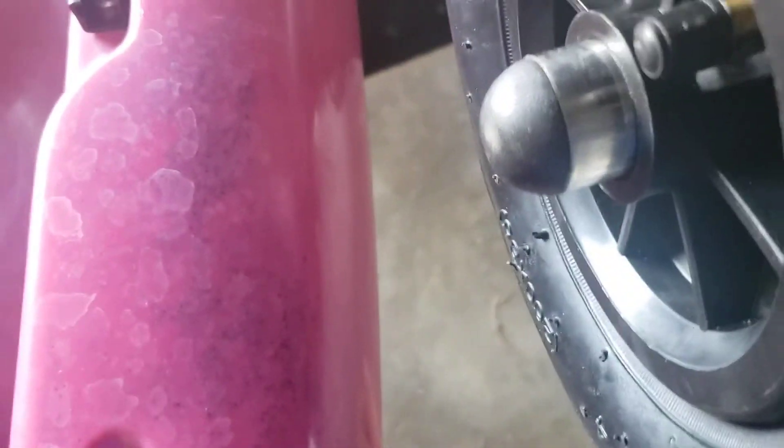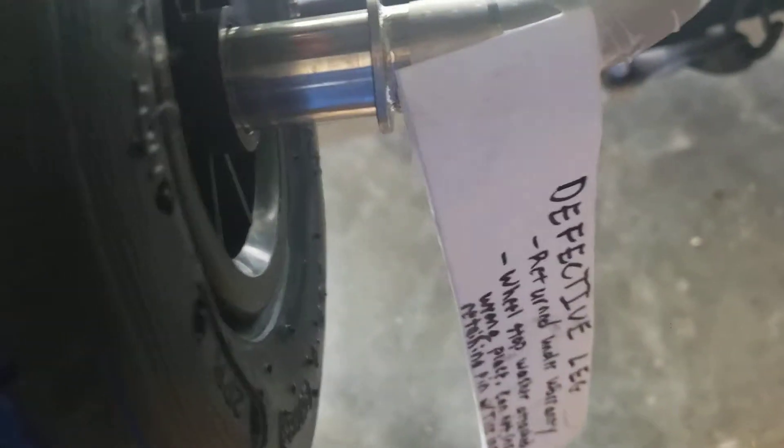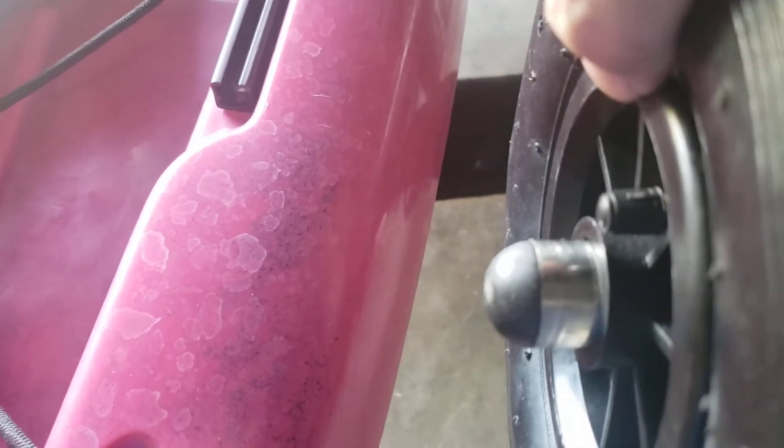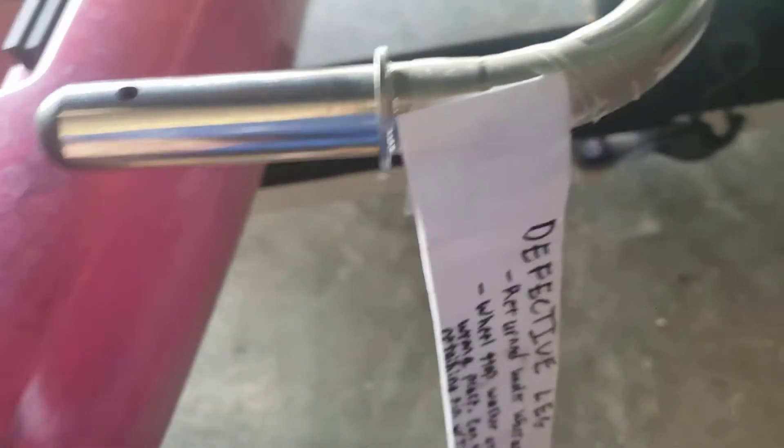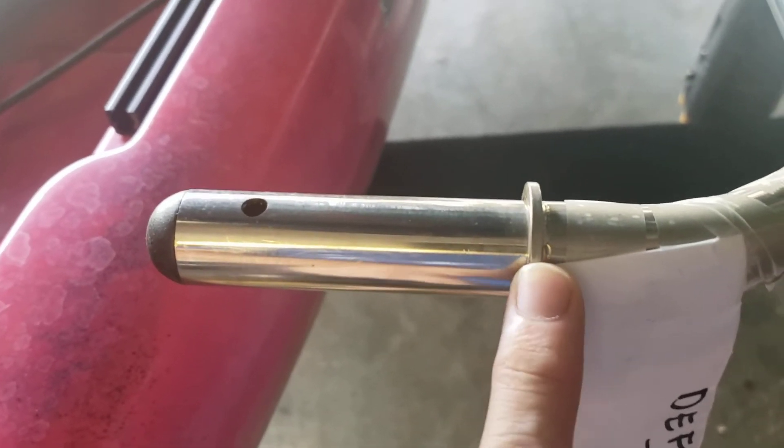Now on the right-hand leg, which is the original one from the kit — I push it all the way up against the stop, you can hear it go home, but on this side the hole is completely obstructed by the tire. It's home, and there's no hole visible on the other side. It appears that during the manufacturing process this retaining washer was welded on in the incorrect location — it should actually be about another inch or so to the right. So that's the bad leg.